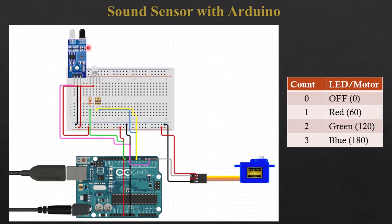This is actually a picture of an IR sensor but I have used a sound sensor in its place. It will have a digital output which is going to be connected to pin number 3 of the Arduino — you can use any interrupt pin. You also need to connect the RGB LED, making sure whether it is a common anode or common cathode type. For the servo motor, it will have three pins and the output pin connects to pin number 4 of the Arduino.